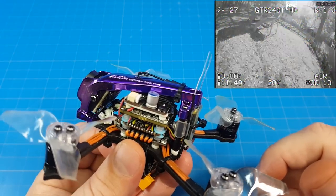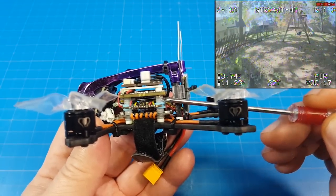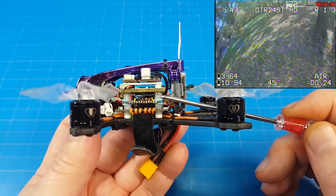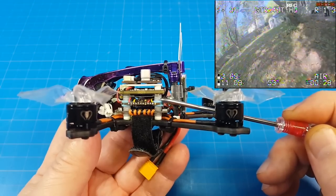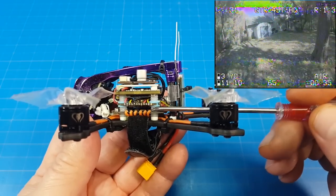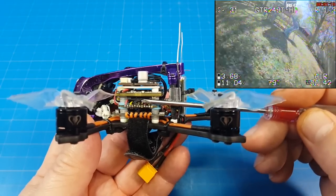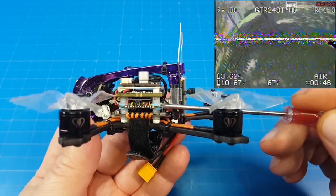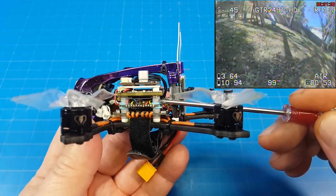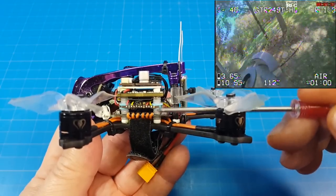There's a high-quality TBS VTX in here. The flight stack still uses the little rubber rings — hopefully you can make those out. I'm not a fan of them only because if you ever have to take it apart, those rings can bounce away and you'll be short one. You need even spacing so nothing touches. That said, I appreciate that they provide soft mounting, keeping the flight controller from fighting vibrations, which should help improve performance.